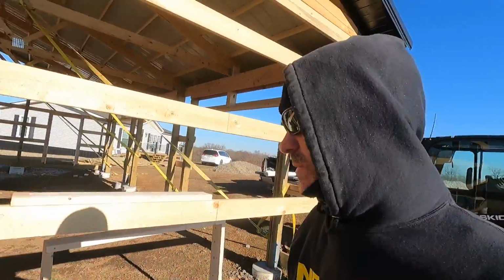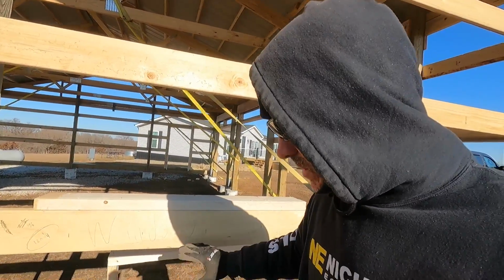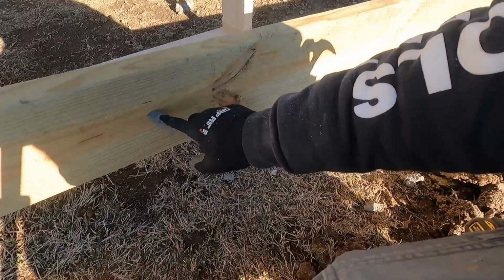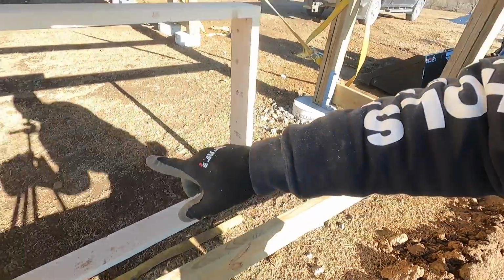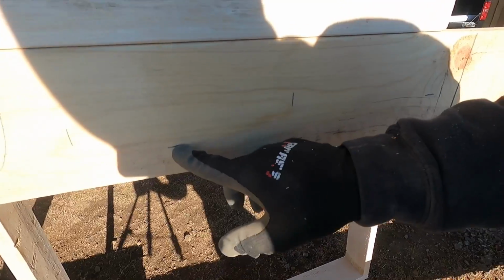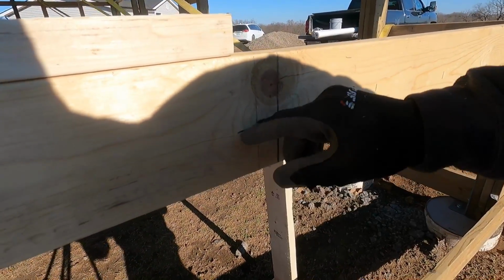All right guys, we're going to frame these windows in, and it's about 41.5 inches is about what it works out. So we have our grade board. Up here is where the concrete is going to end. We have 1 inch for our bottom trim. Then we go up 36 inches, which is right here, to our wainscot trim.